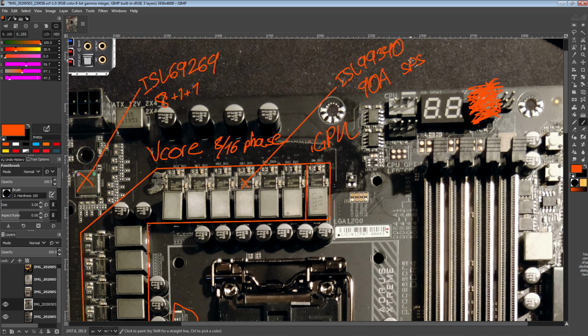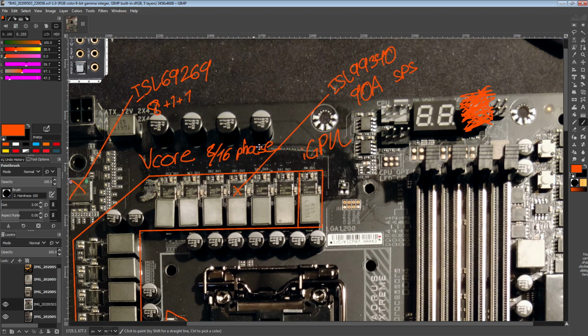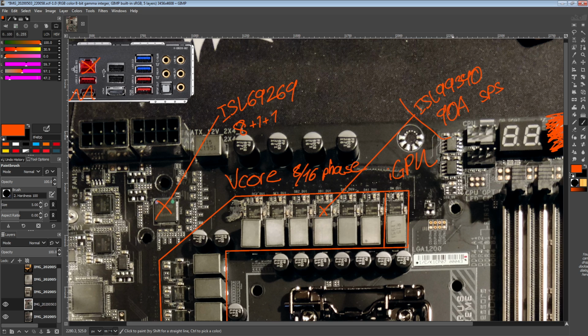There's a lot of Z490 motherboards actually using these, like Gigabyte's Xtreme, the Z490i Ultra from Gigabyte, the Master from Gigabyte, the Unify from MSI, the ITX Unify from MSI, the Ace from MSI, the Godlike from MSI. So yeah, for high-end boards, these are very popular because if you're using an Intersil controller, this is basically the best power stage you could pair it with, and still have full support from Intersil.